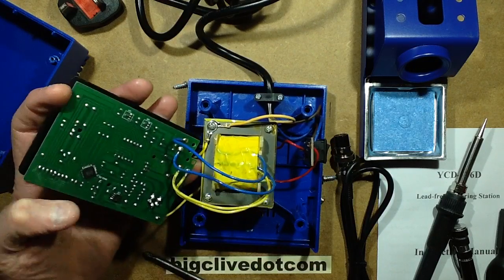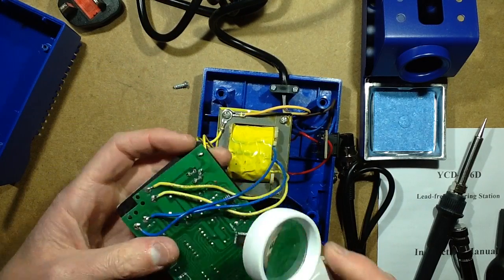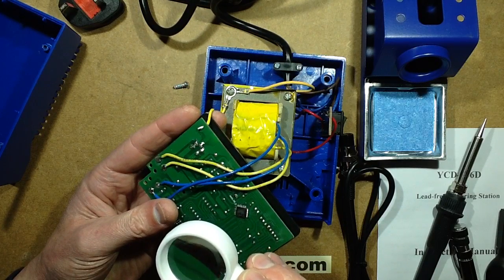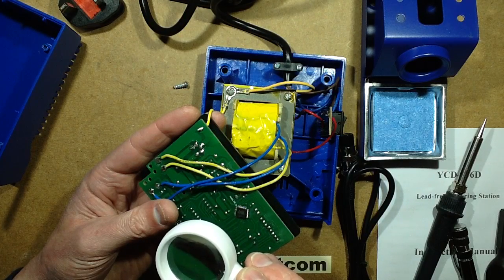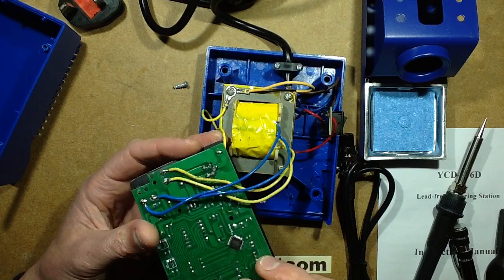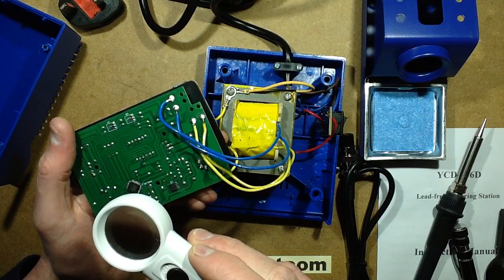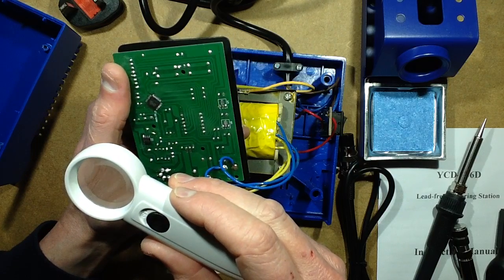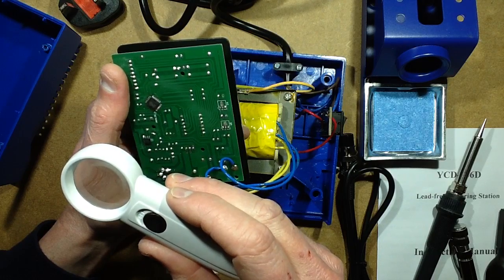There's a little dinky processor type chip here, which is an ATmega8L, then underneath it says 8AU 1535C. Okay. This little thing down here, I wonder if that's just a little op amp or something. Oh no, it doesn't look like it. I'm not actually sure. OP07C. OP07C? Oh, I'll have to look that up.